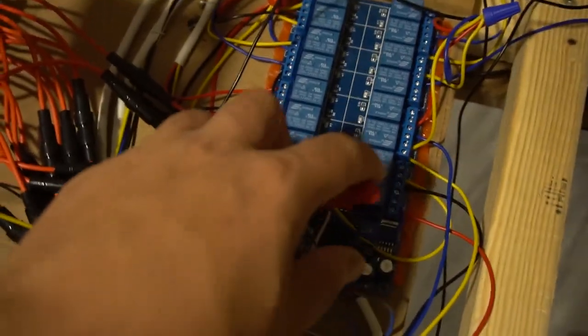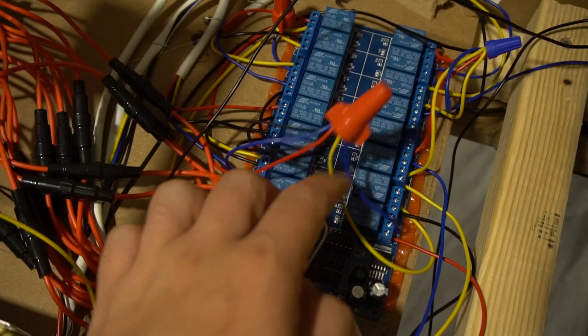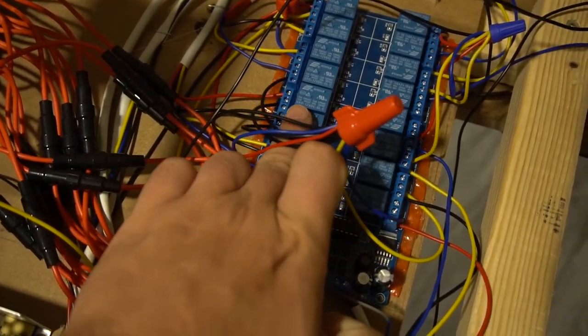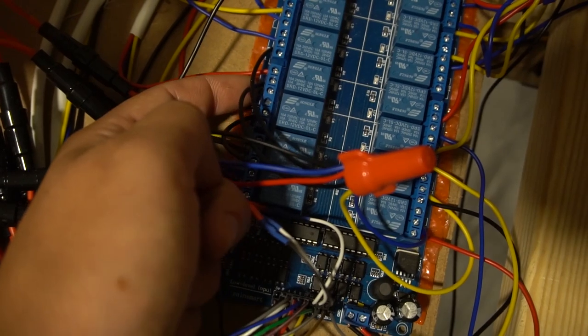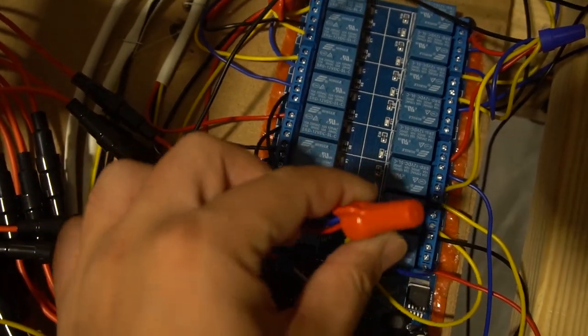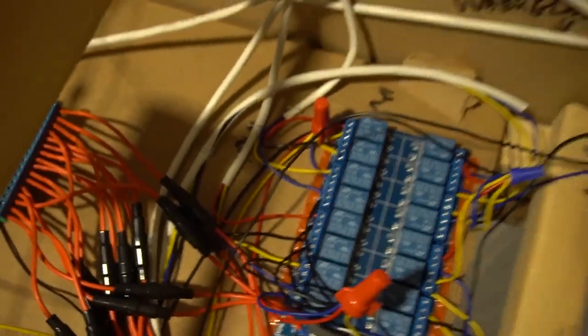You can literally see the other ones here. Right here is a 24 volt daisy chain. It is going right now to 1-2 and a couple of these on the left. You can see these are all linked. They're going in the center of the channel. That is where your power goes in. Again, 24 volt positive, not negative, positive.